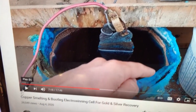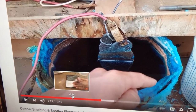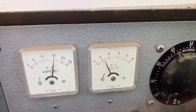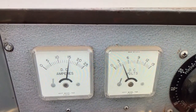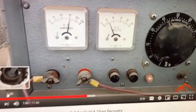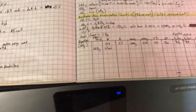I'm not sure what power supply Jason is using in this video, but we were using very low voltage. You can see he's running over 3 volts — that is just way too high. You're going to be blasting copper off that anode at that rate. The structural integrity of the anode face begins to deteriorate more rapidly than the copper can be eaten away, because of the different metals present in the anode alloy. We were running 1.2 to 1.5 volts, sometimes as low as 0.6 volts — usually well under a volt.